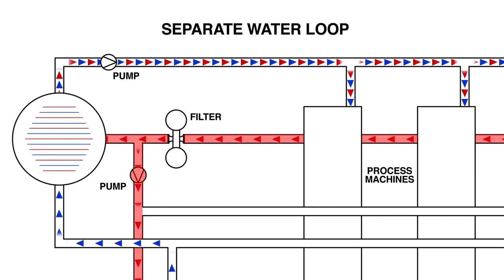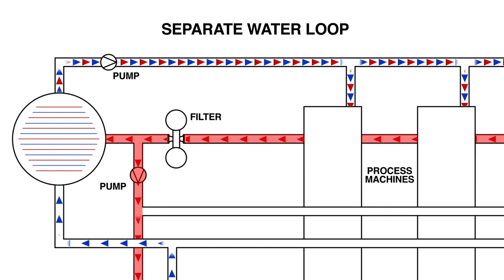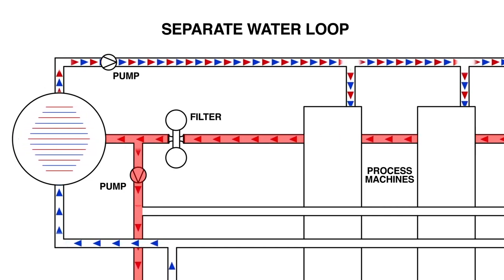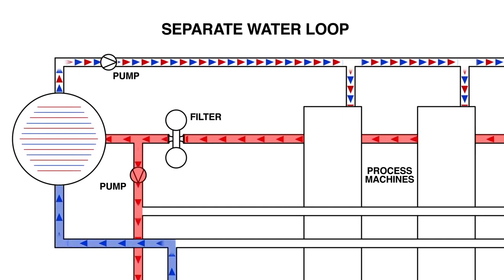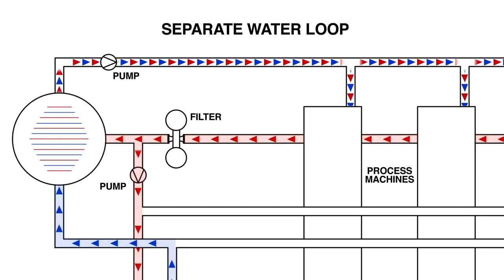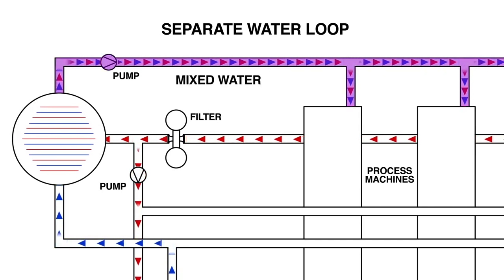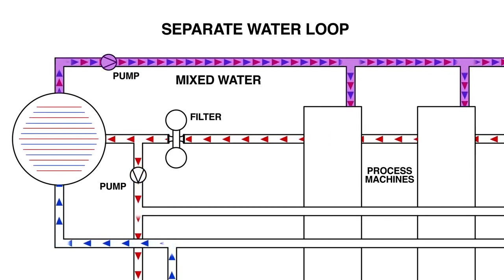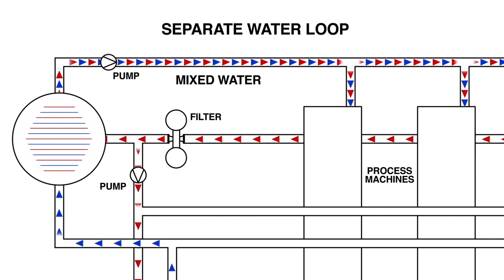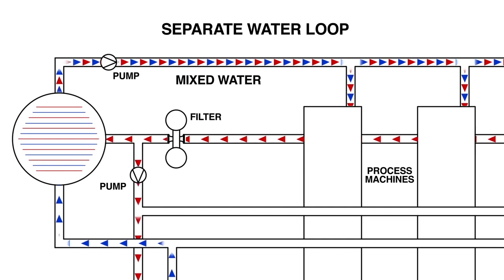The mixing tank takes the water off this machine, even though it's a low temperature rise, and mixes chilled water with it to cool it down, and therefore it goes back cooled. That's how we're cooling that water, and that's in its own circuit or loop, as you know. We've got a 25 horsepower, or 20 horsepower, water pump to do that.